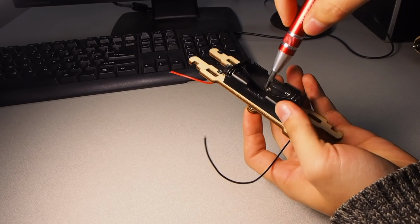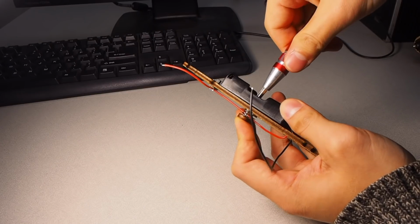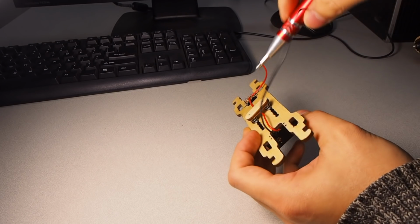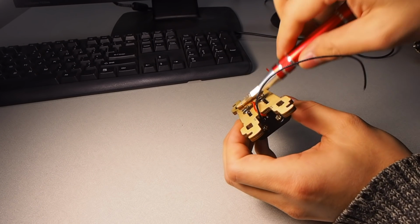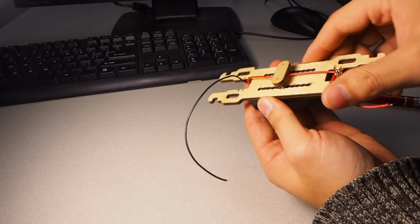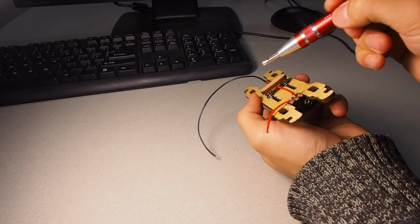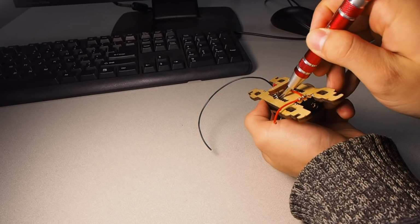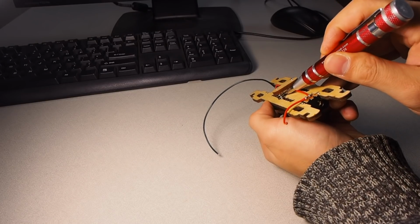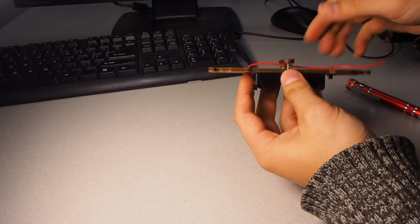On the other side, screw in until you feel the tip. Adjust a little bit so that the bar is parallel to the belly piece. And observe these springs. Make sure that this spring is not getting into the track. Otherwise, it will be the obstacle for the screw to move.